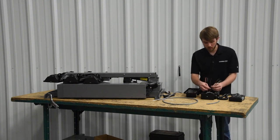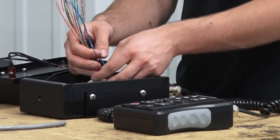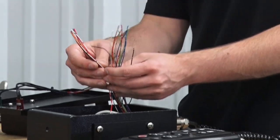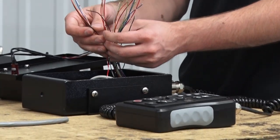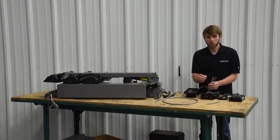Use your wiring schematic at this point. You've got 20 wires here and not all of them are going to get used. The wires that you don't use — which you'll see on the schematic — need to be capped off. We'll send some little pieces of heat shrink that you can heat down on the ends of these. They will be 12 volt positive wires, so we don't want them arcing on anything in here and causing a short. Make sure to cap those off.